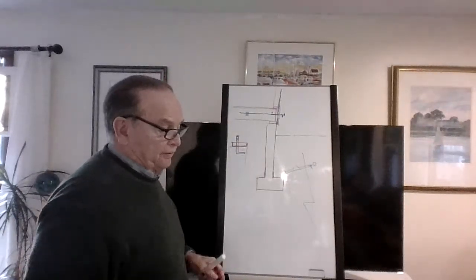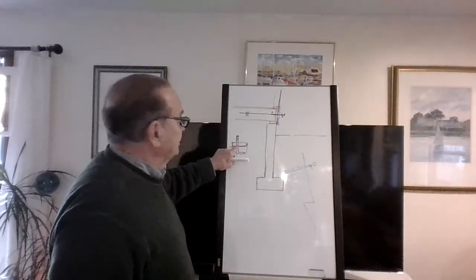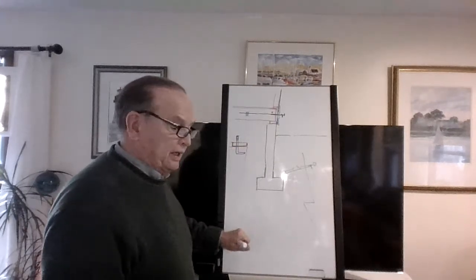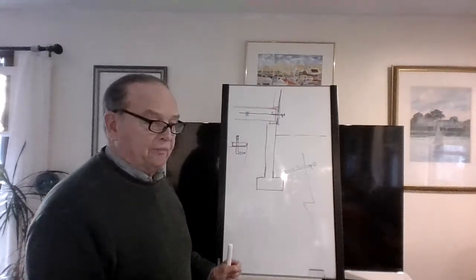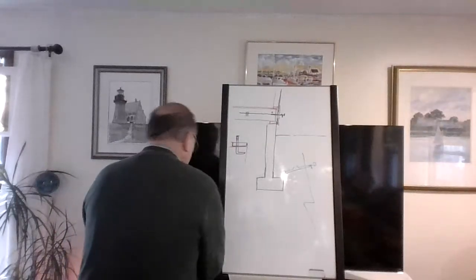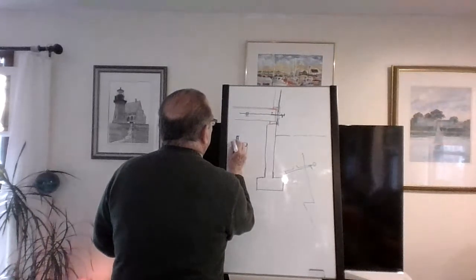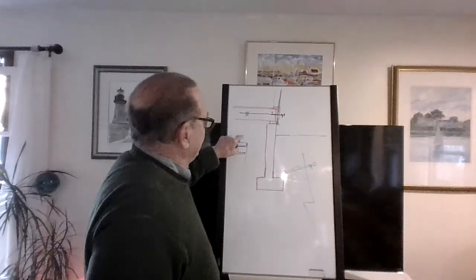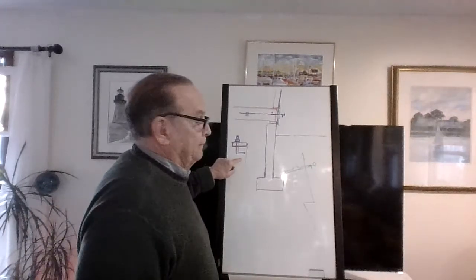So what they do is, I've done it a few times myself, you let the concrete dry. Then when you take the sill itself, you put it on top and you give it a good smack with a hammer. You hit the wood and it marks where they are. And then you drill through, and that's how you put it in. And then I think there's a washer and a nut right here that they crank down. Okay, now in theory, I guess that's supposed to hold the wood to the foundation. I don't know how good it is, but it's there.